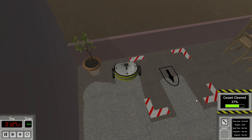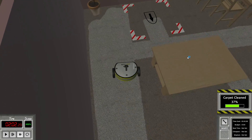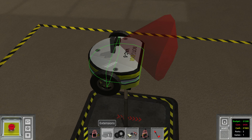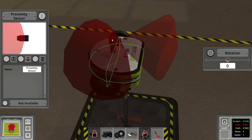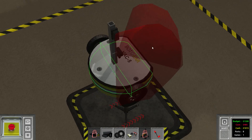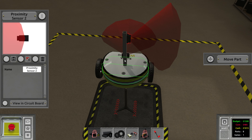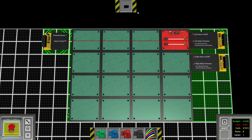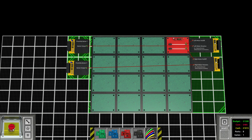Looking better. We might be in a vicious circle again, but we made it out the first time. I'm going to speed it up a little. Do we have flip-flop gates? No gates here. Maybe we need an additional sensor. If I added another proximity sensor — I just need to make the stick longer, or just add a second one. If we detect something on the right side we turn left — actually I think we need to place it on the other side for this to make sense. We go back into the circuit board and wire this proximity sensor to reverse the other motor. Now we have a bit more randomness.